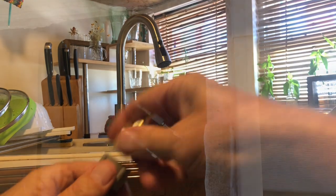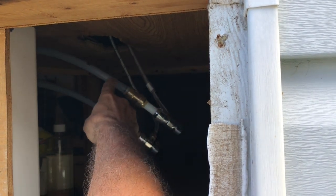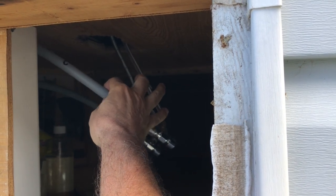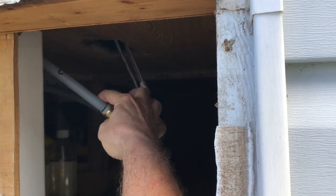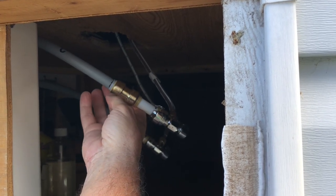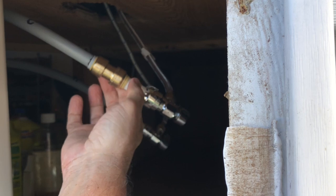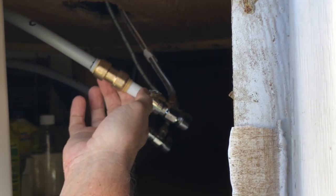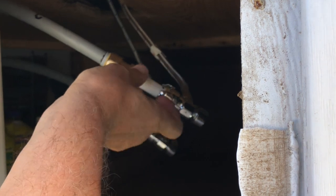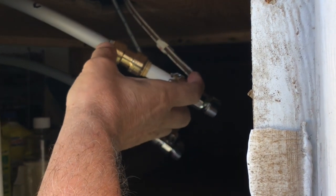So I'll show you what I had to do. Here's my fix. This is the gray polybutylene old mobile home feed line. What I did — I cut it off. And then this is your SharkBite coupler; it goes from polybutylene on this side, and then on this side you put a little piece of PEX. I bought a short piece of PEX — I think it was like four dollars — and I cut off a three-inch piece. You might want to use a little bigger, but I popped the PEX in here.